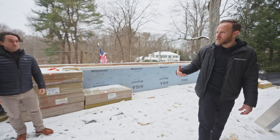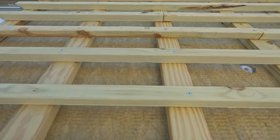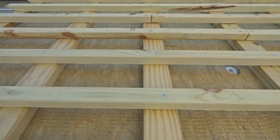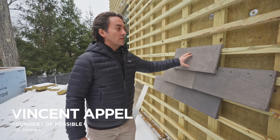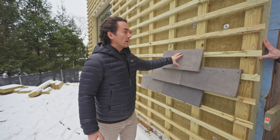I brought Vincent, who is the architect on this project. Vincent, I want you to help walk through what we've got going on outside of our WRB layer. What is this expanded rain screen detail that we have here? This assembly is essentially a deeper, heavier insulated exterior rain screen.